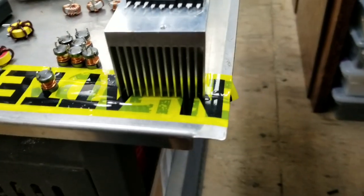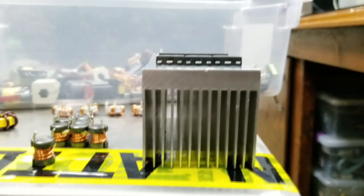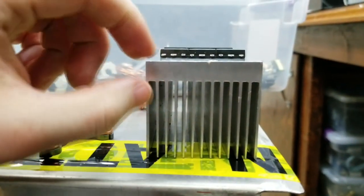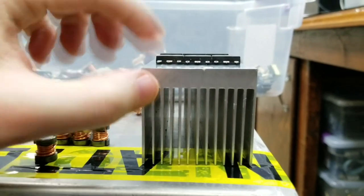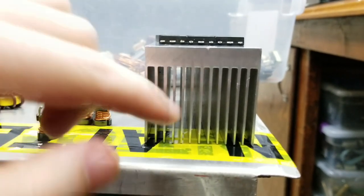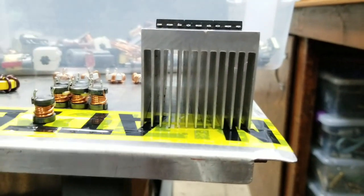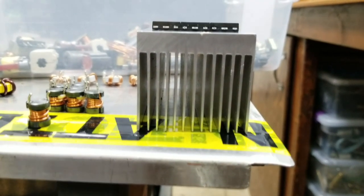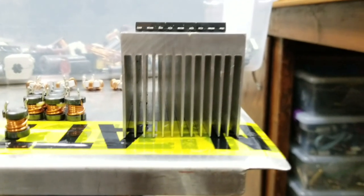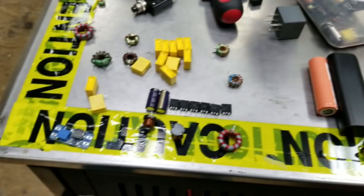This particular heat sink is small yet really, really good. It has a nice thick top section which allows me to drill and tap holes for standoffs for the circuit board. We're going to put a fan here and a fan there, and it's going to sound amazing because they run at the same speed and synchronize — it's going to sound like a VFD.